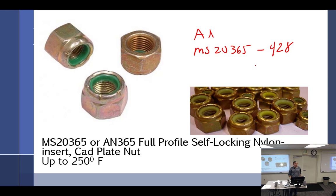So same thing, they're going to give you a chart and say, you could set your torque wrench for this number, and when you start it and you get to that nylon part, the wrench better click before you start putting it on. Do you follow what I'm saying? Yes. Okay. Given that, we can reuse.